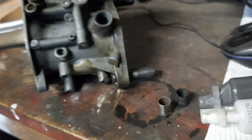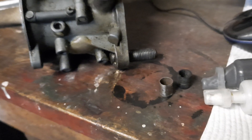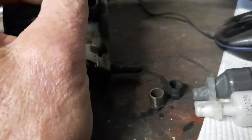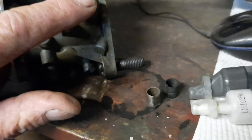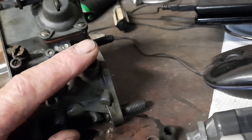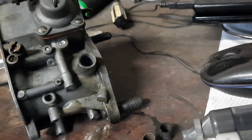I'm going to wash it in there, then fit the linkages and the washer — that could be interesting. I might have to try several washers, or maybe even cut and punch a little plate. You want it just tight enough to hold the o-ring into the body, but not rubbing against the linkage or preventing you from doing the linkage up tight so it doesn't come undone.